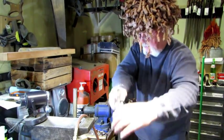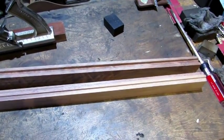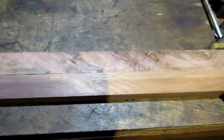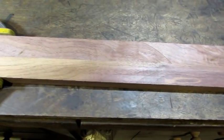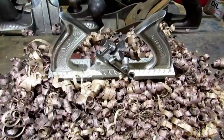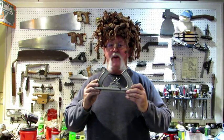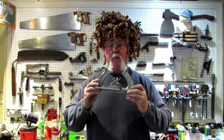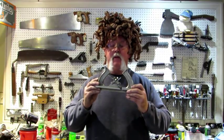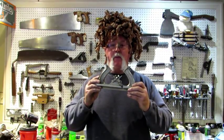Just like the groove, the tongue is going to stop automatically when it's deep enough. I'm not getting any more shavings so that means we're done. When she's all done you end up with some nice looking tongue and groove — and if I hadn't assumed that my boards were straight and jointed them first, I wouldn't have had to use clamps to pull them together to show you what the joint looks like. The old plane made a substantial pile of shavings, so the old 148 performed quite well — but I'm not so sure I'd like to do an entire house worth of hardwood flooring, that would be a lot of work. Well, that's it for today, I hope you enjoyed the video. Thanks for watching, it's time for supper — gotta go, bye!